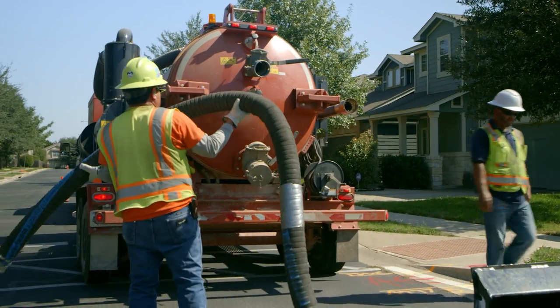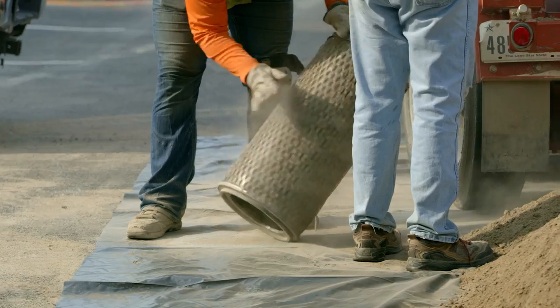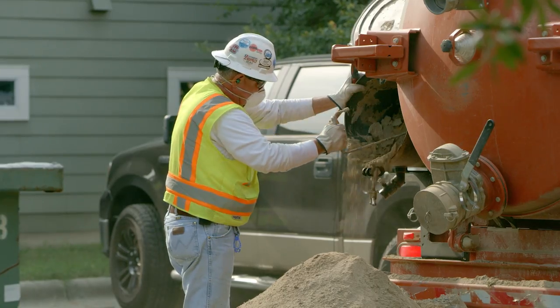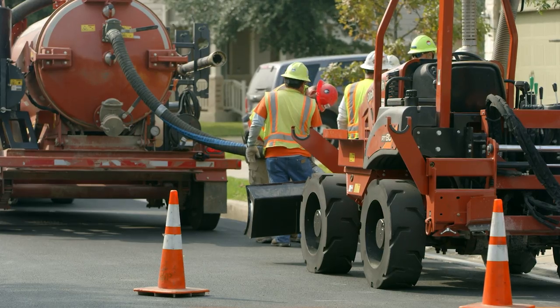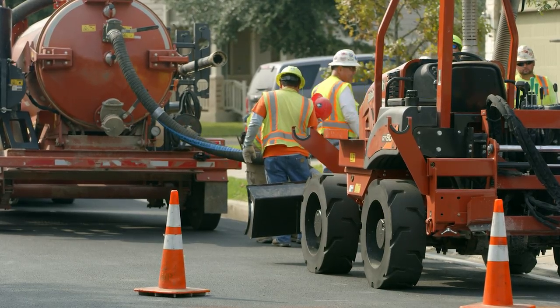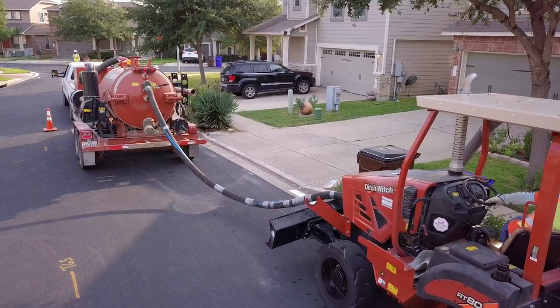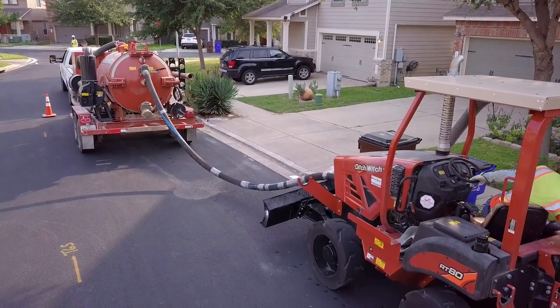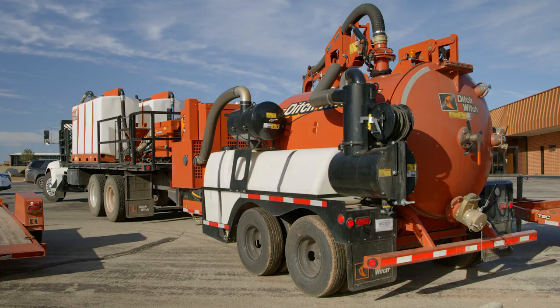If using a vacuum excavator for spoils removal, ensure vacuum hoses are clear, vacuum filters are clean, and separator canister is empty prior to operation. Use the appropriate size of vacuum excavator for the size of microtrencher. Typically, a minimum of 1,000 CFM is recommended with your microtrencher. Make sure the tow vehicle is rated for the weight of the equipment and spoils. If the vehicle is not large enough for the load or sloshing liquid, you can lose control of the vehicle.